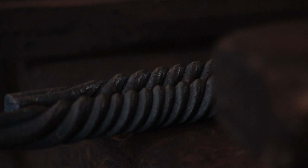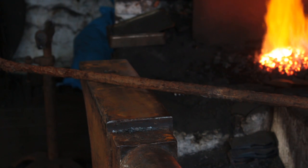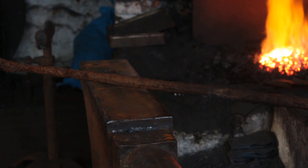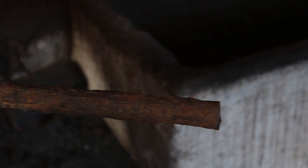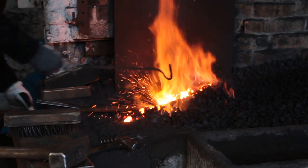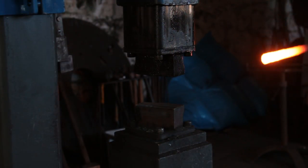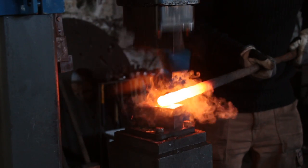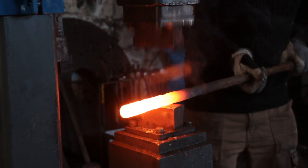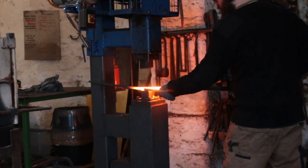Those of you who've been watching this series from the beginning will be aware that I'm creating this replica out of wrought iron. Here is my primary material. We're actually going to draw this to 12mm square — which is half inch for those of you who prefer measurements in English — and I'll do this under the power hammer. It took a while but I'll edit it down to a few seconds.